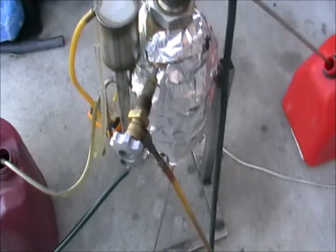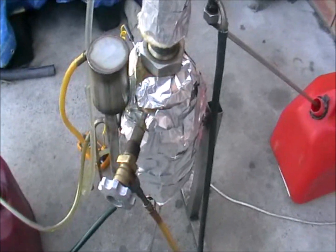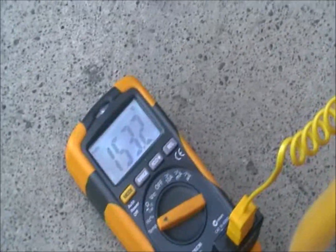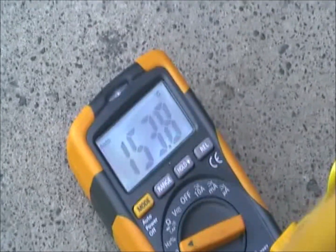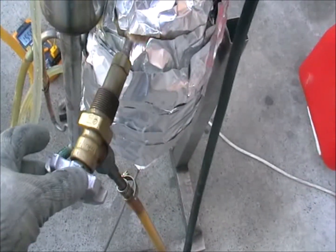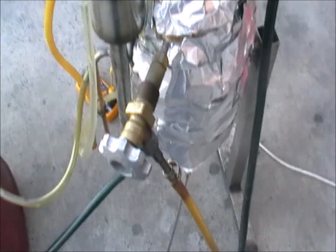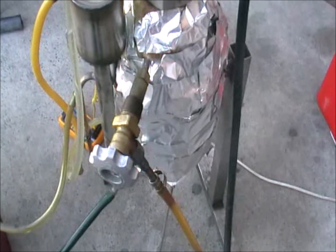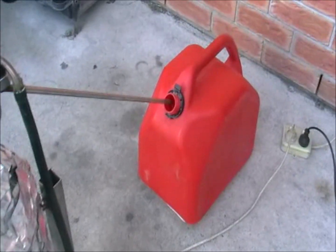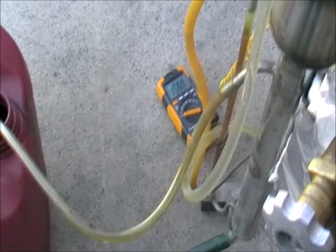That means the oil within the reactor is constantly replenishing, and the evaporation is not faster or higher than the actual supply rate — this is how you ensure balance. You're observing the temperature, and even after increasing your supply you can see the temperature increase. Probably you should still increase the flow control. At a certain point the temperature will stop, and what you've got is temperature stopped, diesel being produced, and waste coming out — this means you've found an equilibrium.